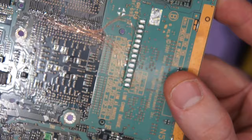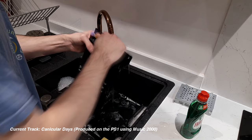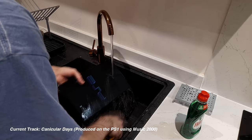And now we are done soldering in the enamel wires — it's looking pretty nice. We're making sure to avoid going right across that mounting hole there because if we were to do so we would just crush those little wires together and cause issues. Now that the hard part's done this is where I like to go ahead and give all of the case a really good deep clean. Make sure everything is spotless and ready for its transformation.